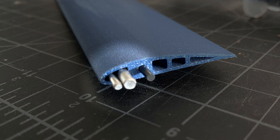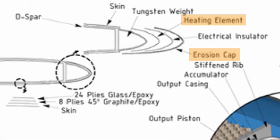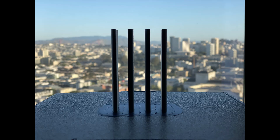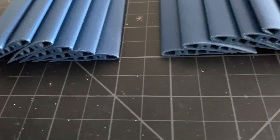The general idea is to use higher density materials for the leading edge. Real helicopters have an erosion plate and a heating element to reduce ice accumulation in flight. They also use a tungsten weight in much the same way we're using steel here. Turns out tungsten rods are absurdly expensive, and steel is almost good enough. The airfoil itself is carbon fiber reinforced PETG, printed with its Z axis oriented with the span-wise axis.